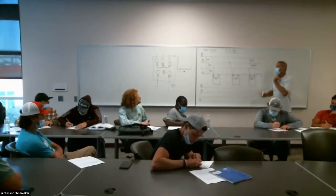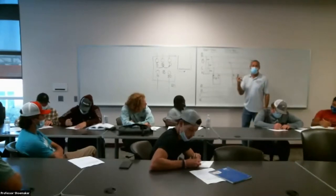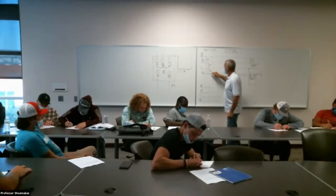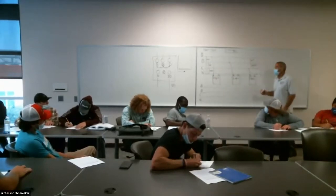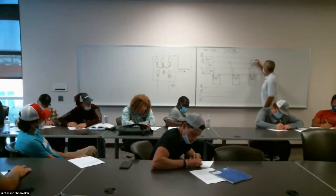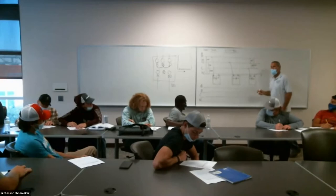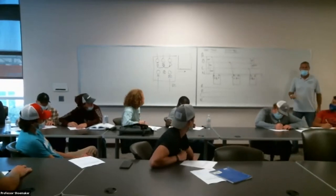Are you okay with this, Professor D? Everybody draws the lines and puts in 2400 one time. I'm okay as long as you got the connecting lines right. I'm okay with that. You're going to have to draw it all three times. If you want to draw it all three times, go ahead. But as long as you've got connecting lines, phase to phase, A to B, 4160. B to C, A to C, 4160, you're good to go. Am I done with primary side? Okay.